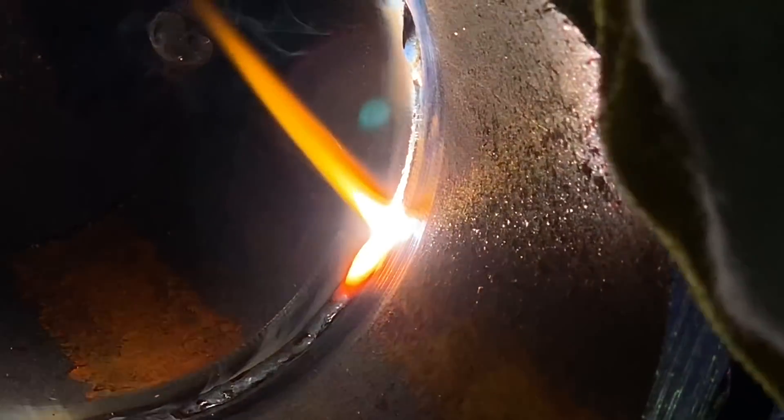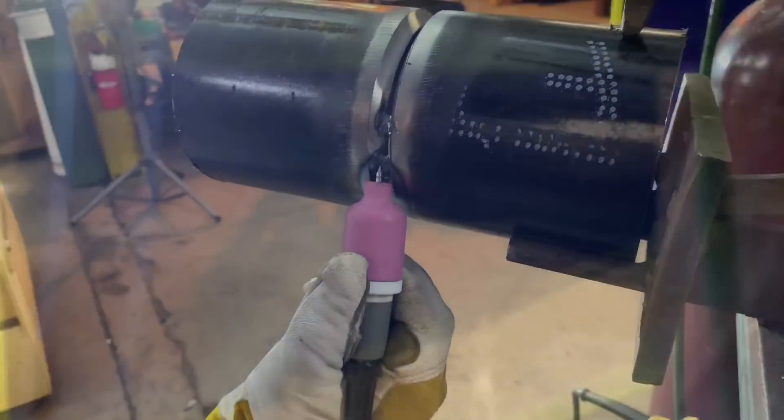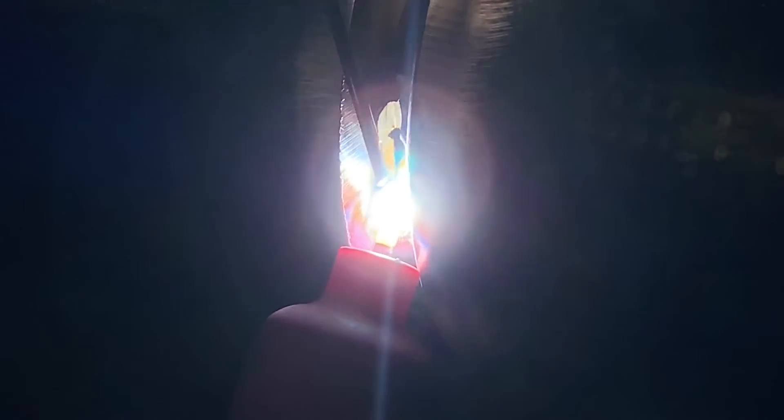You can see there's no wire on the inside of the pipe. As you come up, you're just stabbing wire through the heart of that puddle. So if the puddle starts growing out towards the tungsten, you know it's not going to the inside of the pipe. Either the puddle's too cold or you've added too much wire at the wrong angle. There's an angle you've got to add the wire, and there's an angle you've got to hold the tungsten. The tungsten needs to be straighter in — you need to almost have it straight in. There are a couple little keys in finding the sweet spot on this.